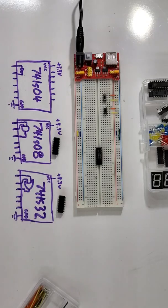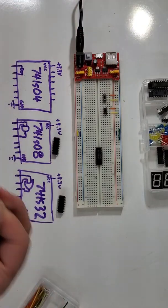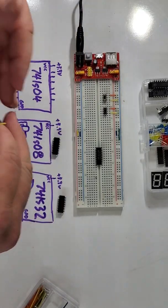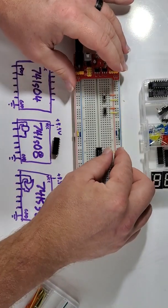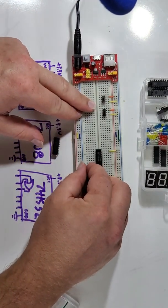So what we're going to be doing is we need to connect our chips to power and ground in order to have them work. The reason being is that basically our gates are able to channel power or ground to their outputs. They'll connect the power and ground to the output depending on the conditions of the inputs, but the inputs to the gates do not supply power or ground to the output. That power or ground comes from hooking it up to VCC on the upper left, that is our power section, and then to ground on the lower right of the chip, that is our grounding section. We will do this for every chip we use all year.